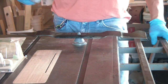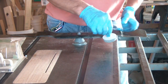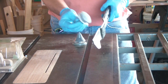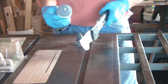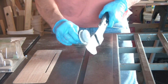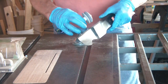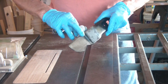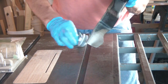This kit actually comes with a tool that you put on your drill and you can grind the blade. Now this is good for a straight blade, but this is a mulching blade, so it's got this arch in it. I'm going to still use this because of the damaged area right here — I'm going to keep going back with this on both sides and check the balance. Once I get it pretty well situated, I'm going to go with a hand file and get this little dip area on top of the blades as best I can.